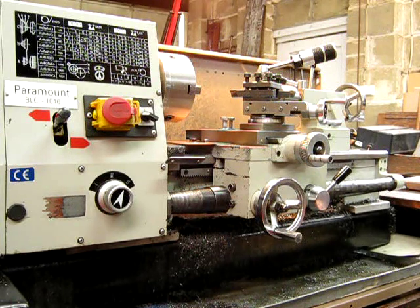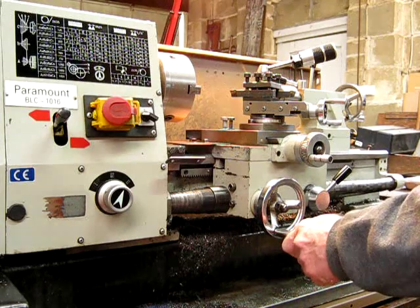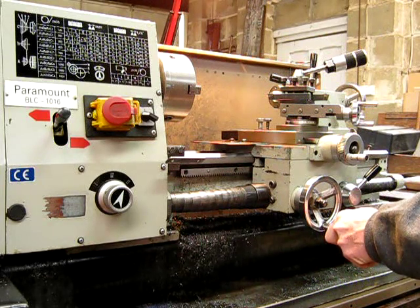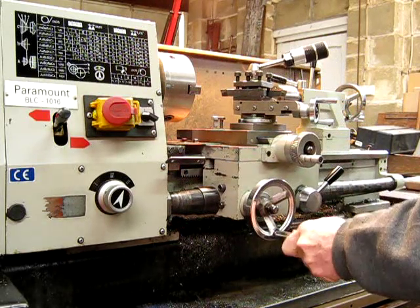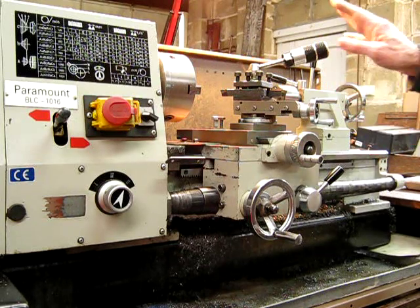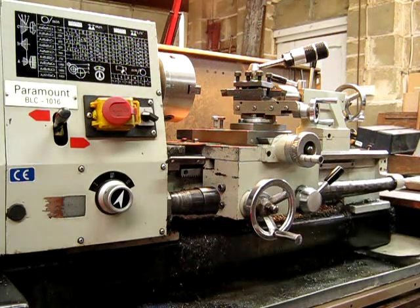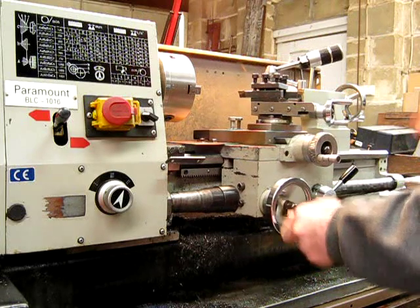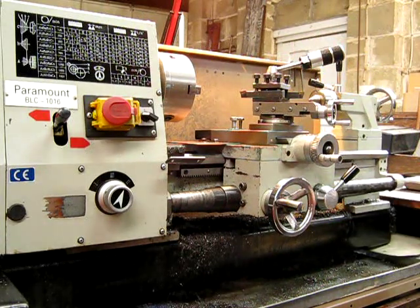That's about it on the lathe — I've tried to go over the basics. Once again, don't fall into the 'mine's bigger than yours' syndrome and buy something bigger than you really want — it's a pointless exercise. A lot of the little lathes are really very nice. I considered smaller lathes than this and also geared head models; I went for this because it's the ideal size. Bed length is quite good — the longer the bed, the more chance you're going to get flex, and the shorter bed will be more rigid. I hope this video has been of some use — see you later.